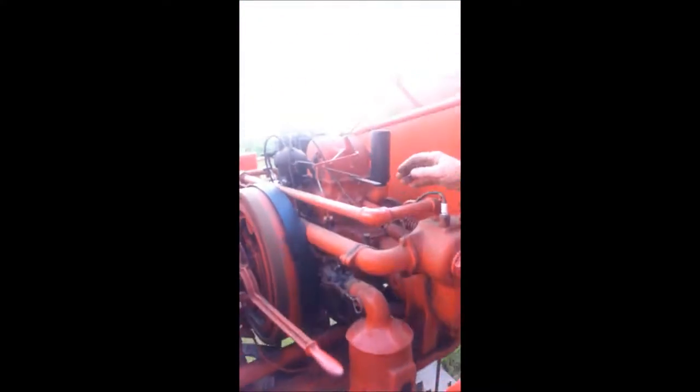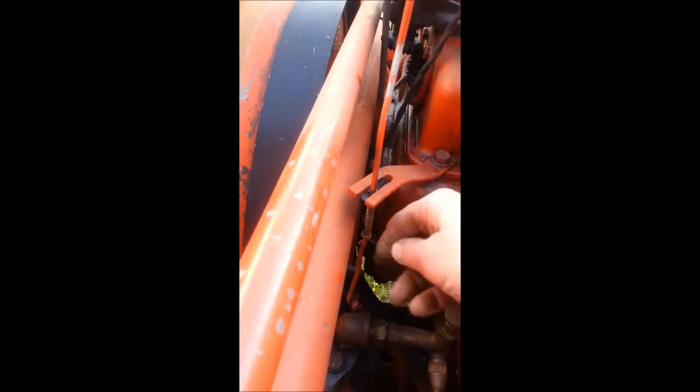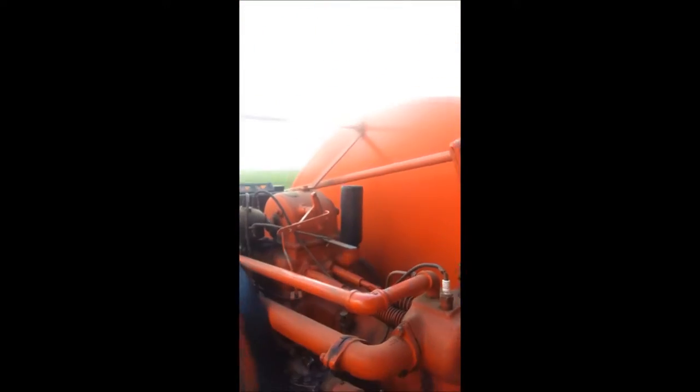This little fork here has a spring on it, and there are holes drilled where you can move a cotter key up and down. The thing lopes — it idles, sits there and hunts for the right speed, fast then low. I saw another guy's Happy Farmer had that thing on there, so I made one of those. That really calms it down and makes it run smooth.